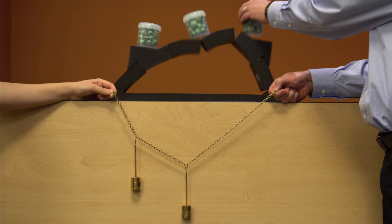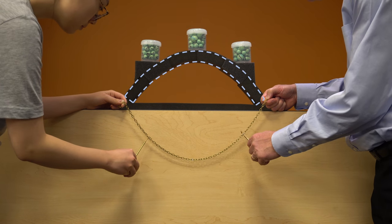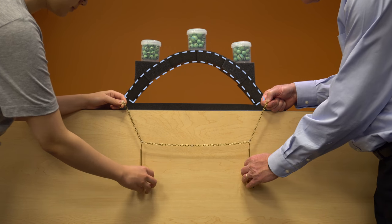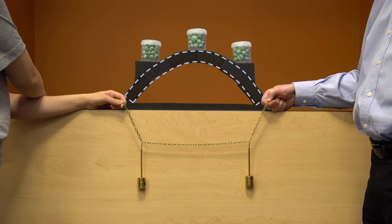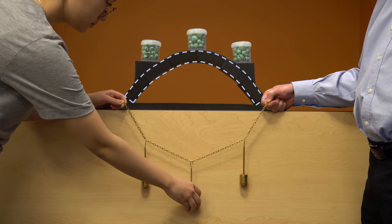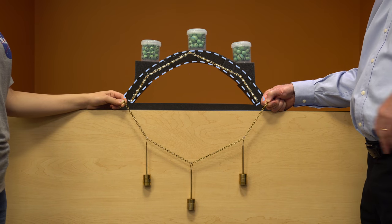It's a little tricky to explain why this happens. Our arches and chains video shows that for an arch to stand, its corresponding chain system, when reflected, must lie inside the profile of the arch. Here is the chain system corresponding to the original arch. The chain and weights have been chosen so that their weights are proportional respectively to the weights of the arch itself and the containers of marbles — it is thus a true representation of the arch. As you can see, the arch passes this so-called chain test.